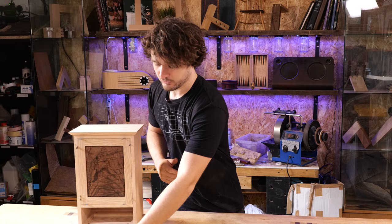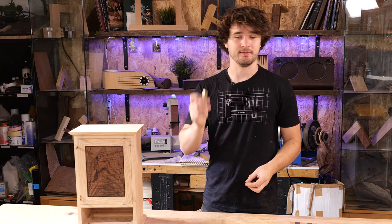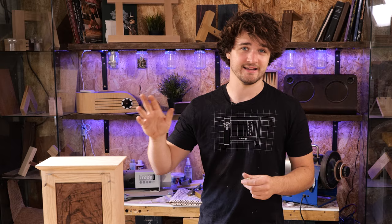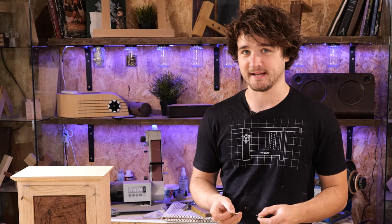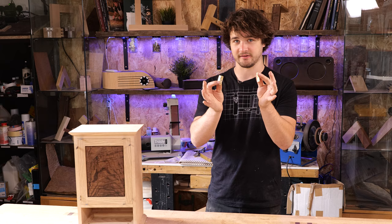At the end of the last video I gave you a call to action to watch my video on how to tune hinges — that includes filing the edges, squaring the ends, cleaning up the faces, and making sure they work exactly as intended. If you buy these from a DIY supplier they're not going to be easy to install and you won't get a consistent shadow gap. With a little TLC they'll work the same as high-end Brusso hinges. If you are using Brusso or other premium hardware you probably don't need to go through that stage. I've already been through that whole process, so these are ready to go.